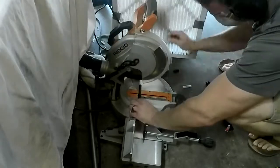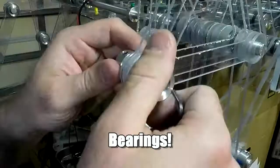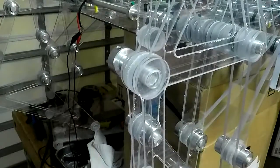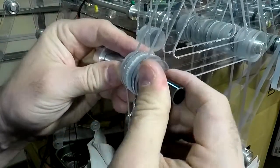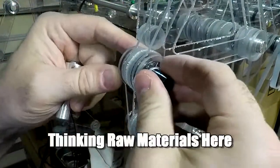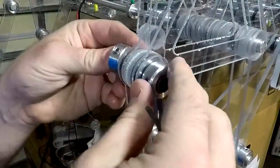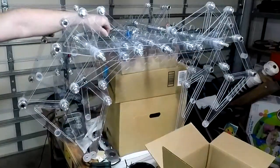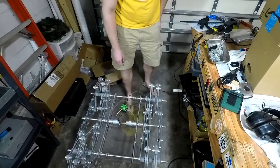This time I decided to reduce weight further by using some carbon fiber rods in place of the aluminum axes, and I also used quite a few bearings. You can see me replacing one of the axes with a carbon fiber rod. Carbon fiber looks like a snake or something — it's one of the coolest things humans have created as far as mechanical stuff goes; you can't really beat it. I stuck it on with a shaft collar, making sure not to tighten it down too much to break the carbon fiber. After adding all those bearings, the carbon fiber looks like it's working really well going both forward and backwards. This did improve things some, but unfortunately it wasn't quite as stable as it needed to be — the legs were still buckling somewhat.